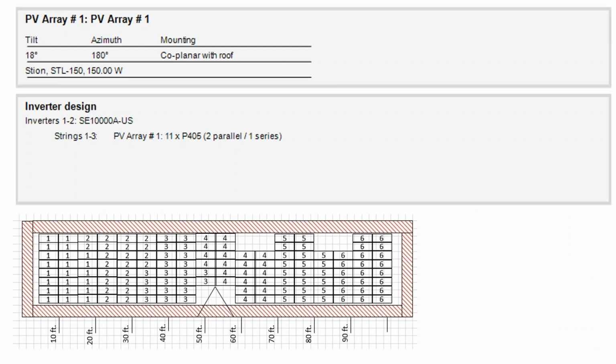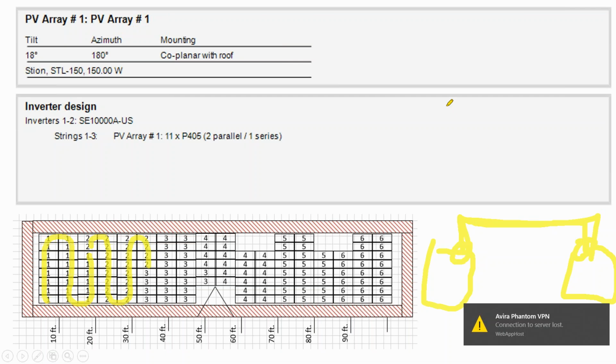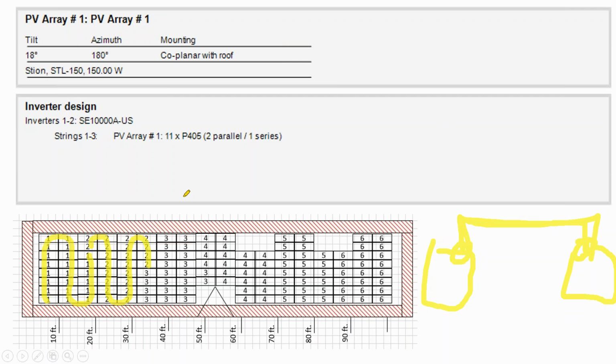So now we have our modules, our inverter bill of material, our racking bill of material, and how many modules go on which circuit. And at that point, where the circuits are at, how the circuits are actually divided up on the rooftop, where they start and where they stop, is kind of where the solar designer might become a little bit more of an artist than they usually are. You know, because these circuits are still by and large plugging into their next door neighbors. And so the circuits have to be contiguous. If they're not contiguous, if you want to start a circuit over here and then land it over here, you can build a jumper cable. That's all right, but that's buying 2 connections, building the cable, additional cable management. You want to reduce the number of jumpers.